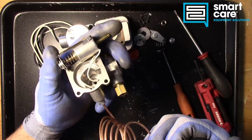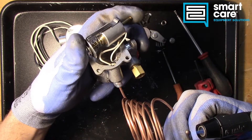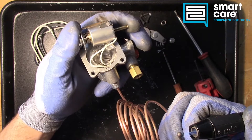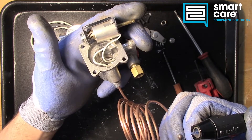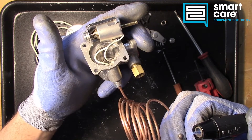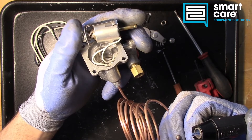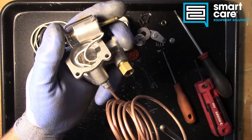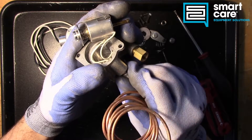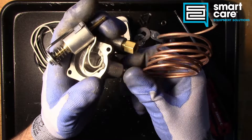So we're going to heat the end of our thermocouple and see if we can make enough voltage to get that to stick. You can see it's starting to stick there — now it's got enough current from that thermocouple that it's able to hold the valve open. And then if we were to loosen this up and break that electrical connection, it pops back apart. Really simple system.